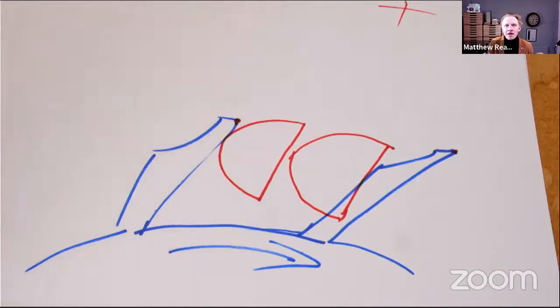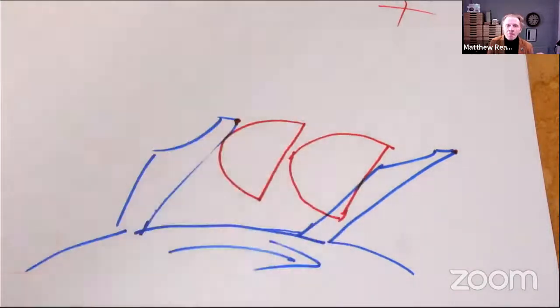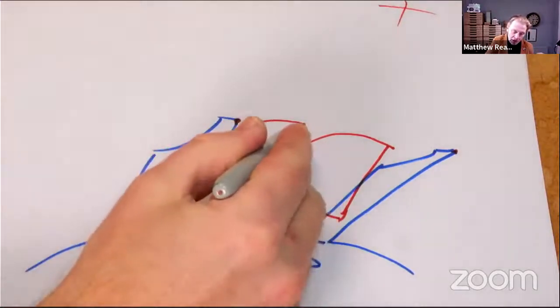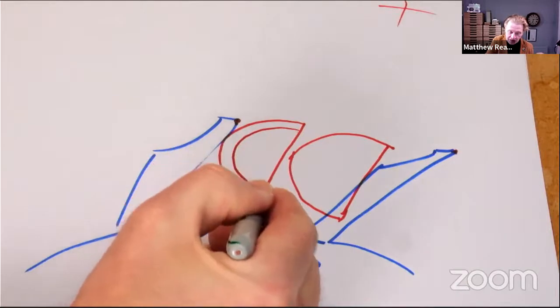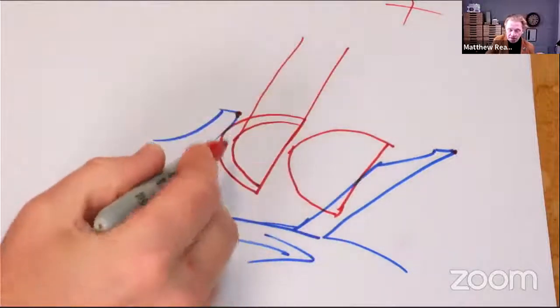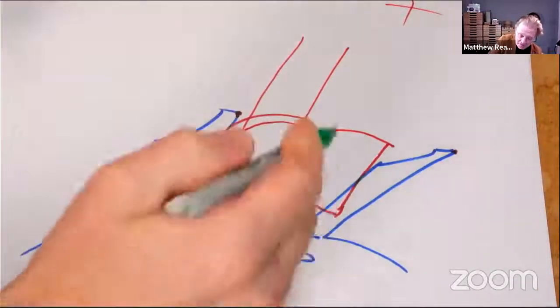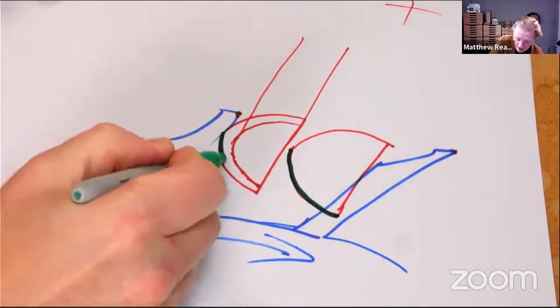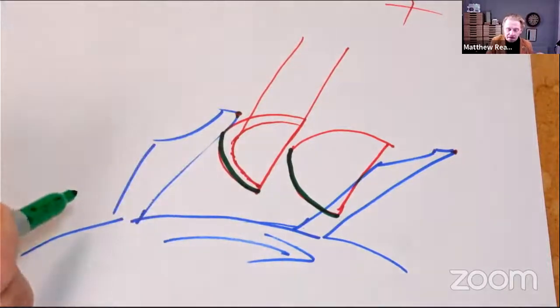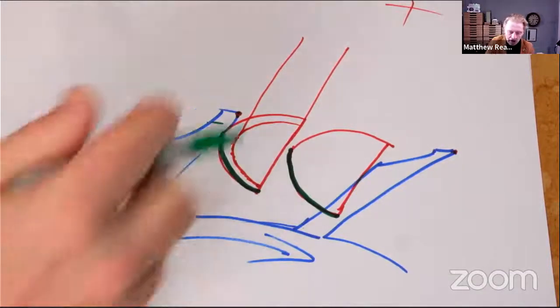When you come to replace the pallets, I think they're only available in kind of standard sizes. So if you imagine you get a replacement jewel or pallet, and it's smaller diameter than this, let's say it's like that, the value from there to there, which is our impulse space, on these pallets is that bit there, and that bit there, you've still got an impulse space, and it's still going to land about in the same place if you glue it in. They're usually held in with shellac in the pallet frame.